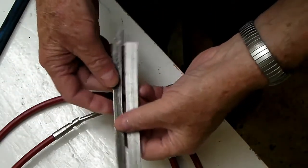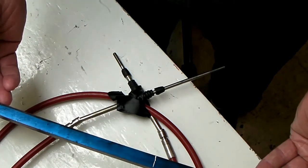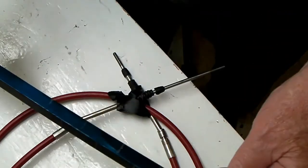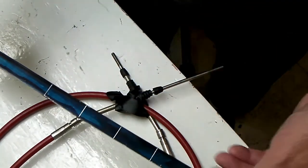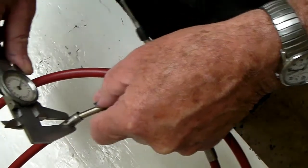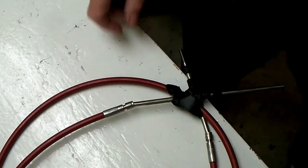I went through my junk and found a piece of jig and fixture plate aluminum that will work great. I marked the centerlines for where the clamps need to go and where I have to make my cuts. They'll be an inch and a half long each, and I'll put the mounting holes in last. I measured the cable: the low spot is a quarter inch and where it clamps is three-eighths. So that tells me the sizes I need to make, and now I'm ready to make some clamps.